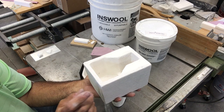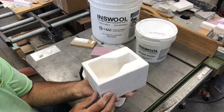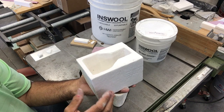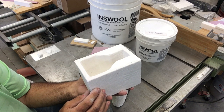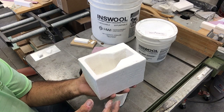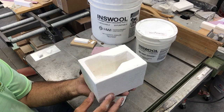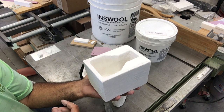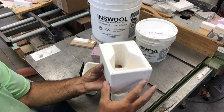It is a different construction technique that anybody could do. The main caveat is you need some pumpable ceramic fiber — available on eBay and from different suppliers online. You can buy it by the tube like a tube of caulk, and one tube would easily do this project with enough for several more. Then you need to be able to fire it. With a resistive furnace or kiln you can fire it to whatever temperature you want — no controlled ramp needed, just up to 1800°F. You could also cure them in a gas-fired furnace if you're careful, not directly impinging flame — maybe stick it inside a can without full-bore heat.